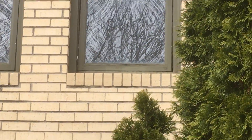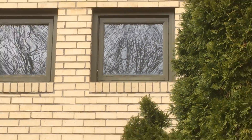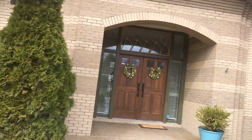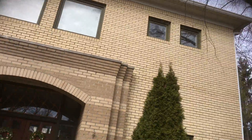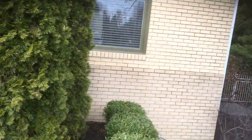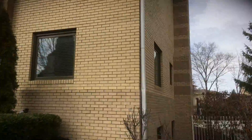The windows in various locations look like they have a little bit of softness to them. As long as it's not attached to the glass, we can dig out the soft wood, put in an epoxy — just kind of a temporary band-aid — so that you can get prolonged life out of those windows. I'll show you better examples as we walk around.